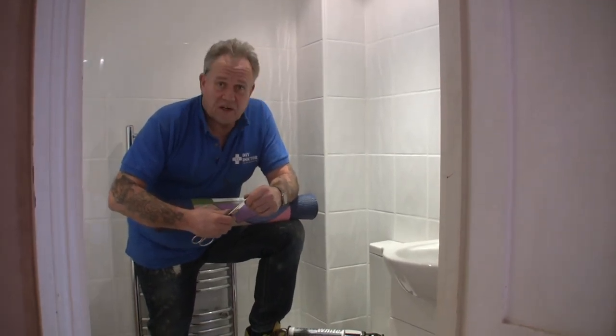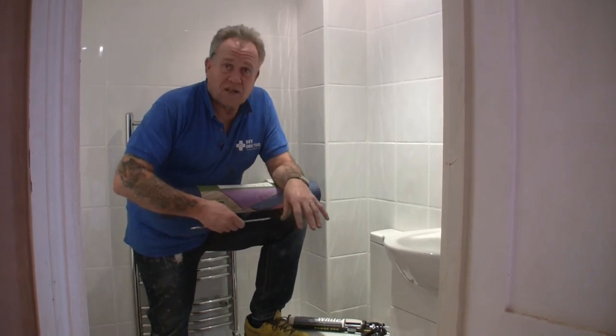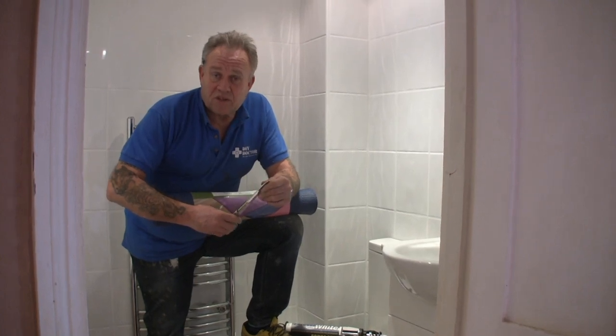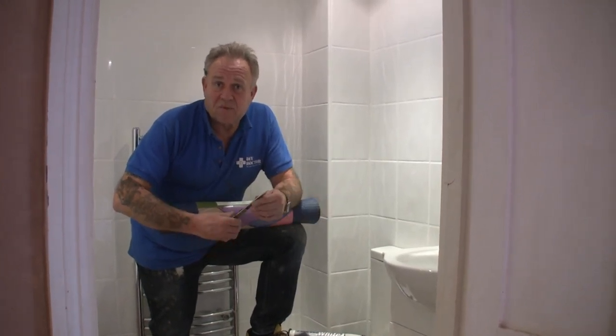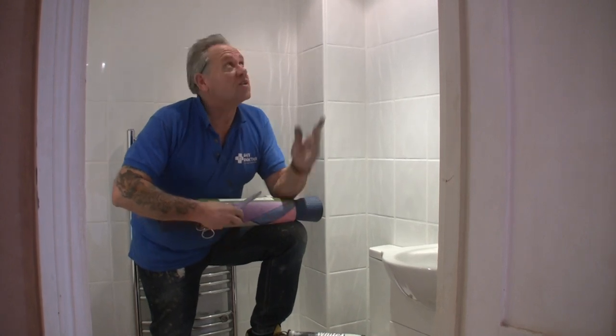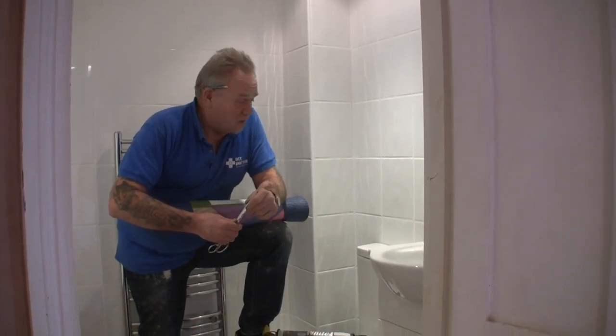The water is very cold, the bathroom is very hot and humid. When the warm air hits the cold cistern it condenses. We often get emails from people saying my toilet cistern is leaking but I can't see anywhere that it's getting out. Well it's actually condensation. It drips on the floor, especially in the bathroom we have upstairs directly above this one. It can rot the floor before you even know it. That also applies to the pipe.